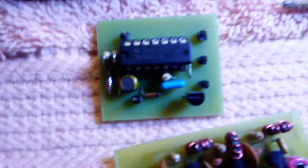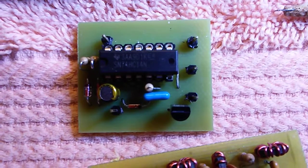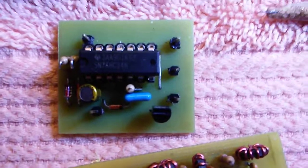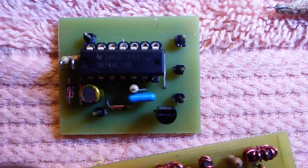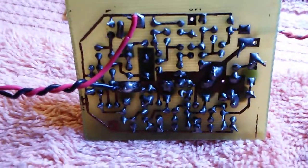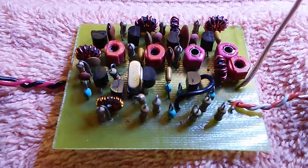In this case, I'm using a 74HC14, which is a hex Schmitt trigger, and that's going to generate the tone and the pulse together. The three pins on the right-hand side of this board are all going to be the outputs. It was an easy build, not terribly difficult. I made the board myself — didn't take long to etch the layout — and it works just fine. I recommend this project to everybody who's interested in transmitters.